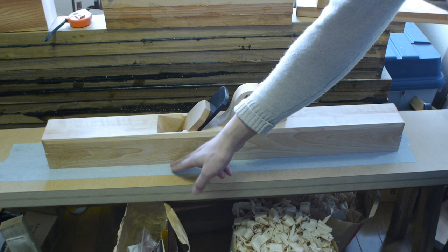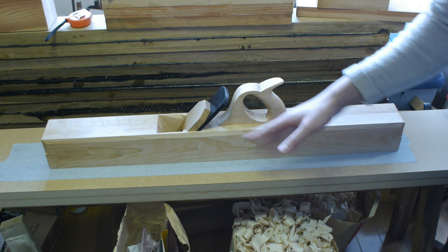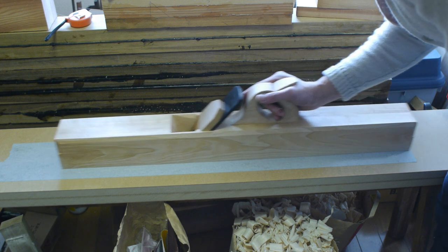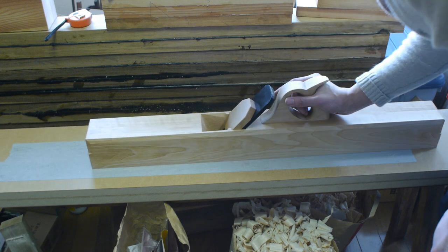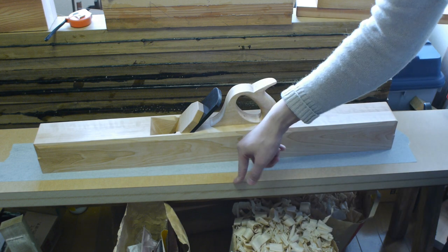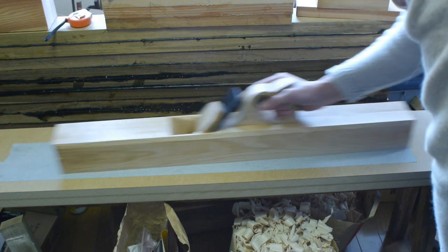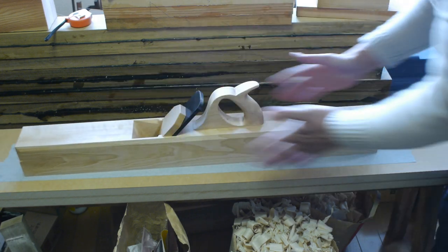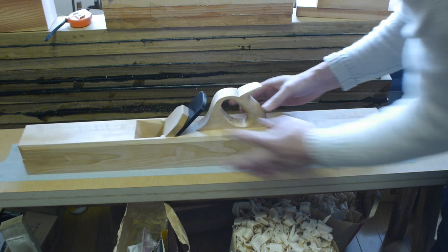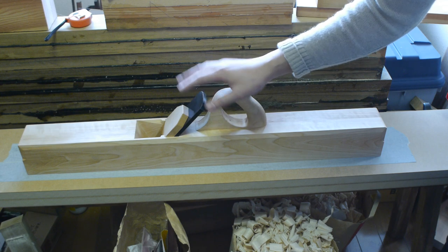If you have a mouth that isn't opened yet, you will either need to plane that down first to open up the mouth a little before you start sanding, or you can just sand until the mouth is open to your liking. Keep going until you have a nice, even scratch pattern all the way along the sole — that will tell you it's as flat as your reference surface, in my case MDF. Don't rush it and don't put any weird, uneven pressure on it as you push; just give it nice, gentle forward-and-back strokes and let the weight of the plane do the work.